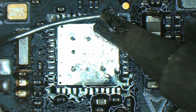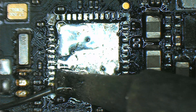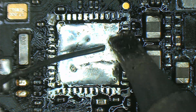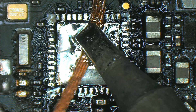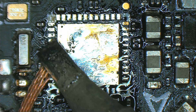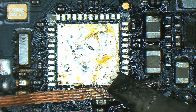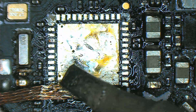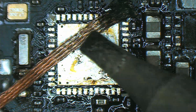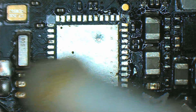Next, we have to place some fresh solder there, then take the solder wick and suck that out. After cutting the solder wick, cleaning up the mess here with a Q-tip and alcohol.